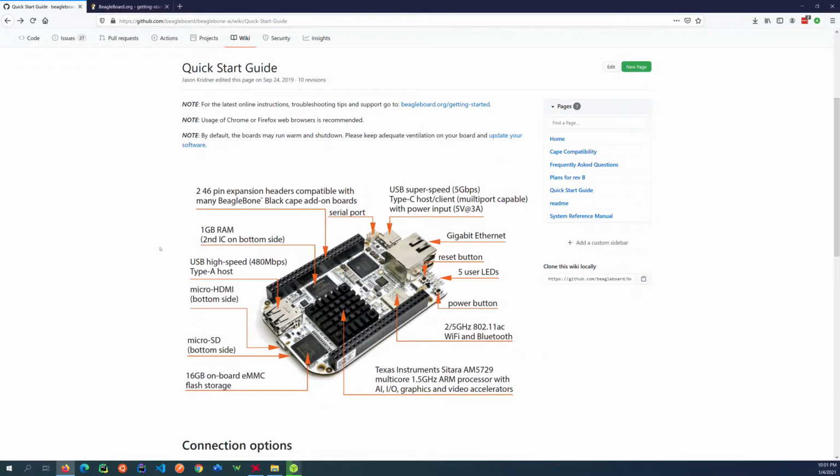It's not something you can do with the Broadcom chips that you get in the Raspberry Pis or the NVIDIA chips. I don't imagine you could do that. I think I've looked for them before too. They're not available through someone like Mouser or DigiKey. I guess you've got to be a volume type shop. So for the hobbyist type people, you don't have access. But all these TI parts you do.